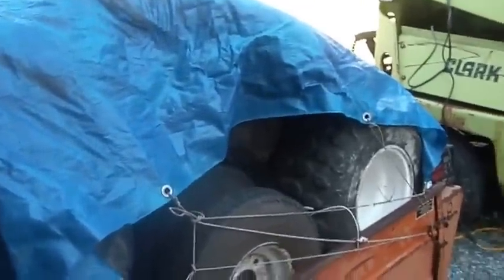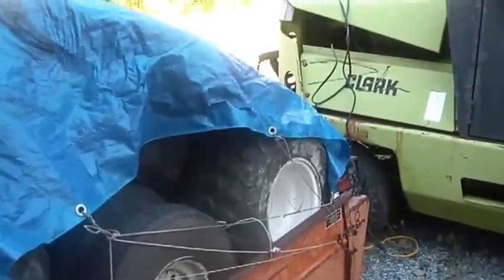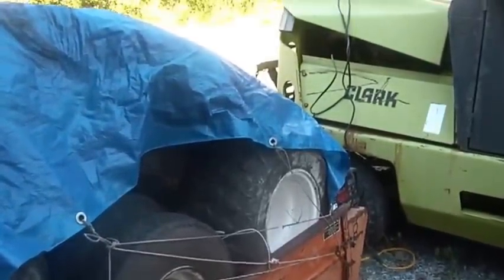If you're really lucky, you could do both, and maybe even start a fire and burn your house down. So I always put a bulb in series with these things as they charge, just in case anything goes wrong. The bulb will just get brighter and brighter, and if something really freaky happens, the bulb will just pop like a fuse. I'd rather lose a $2 light bulb than burn my house down.